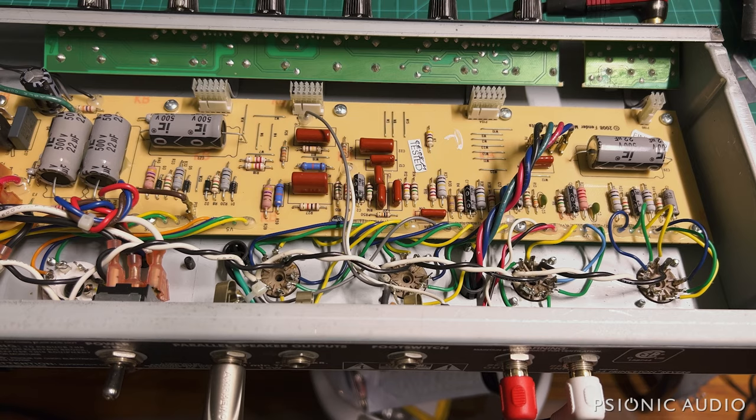The problem turned out to be that MOD tank. I looked to see if it had a grounding error — some tanks are isolated at one end and grounded at the other, some have both ends grounded. It was the correct type for this amp, so it's just a bad transducer somewhere. I hooked up an old Accutronics from about 1972 — absolutely no problem at all, no hum. So the amp is pretty damn healthy.